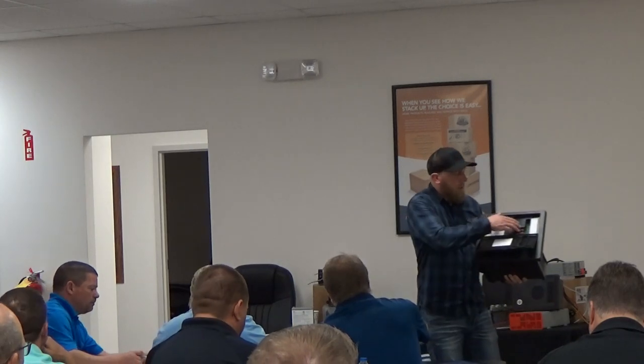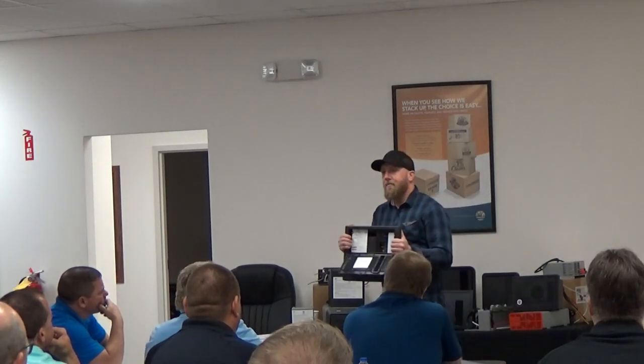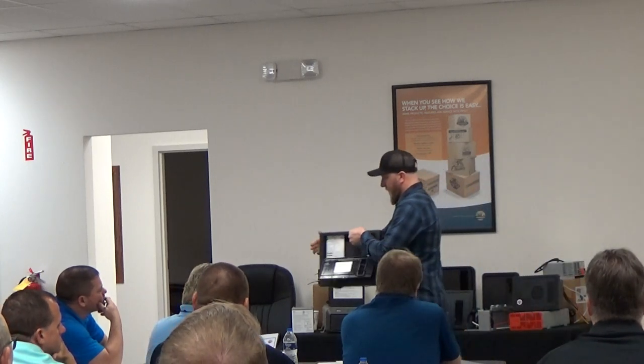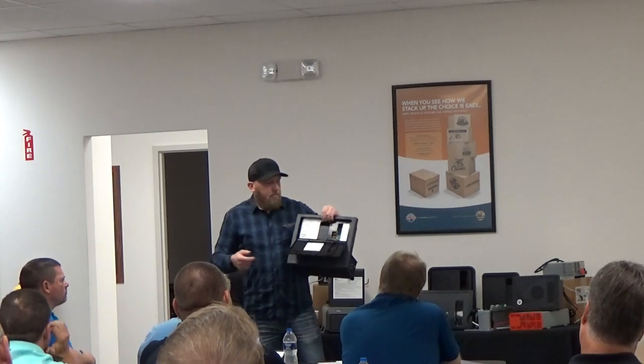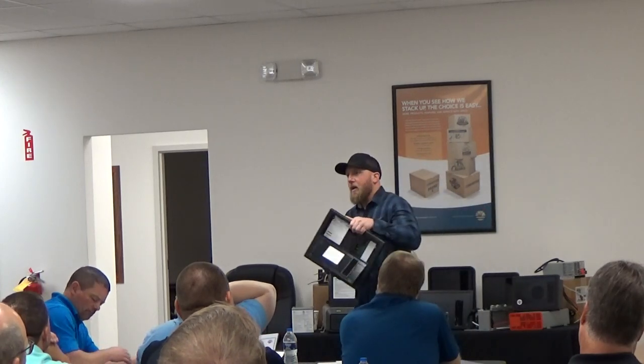Again, with this one, I should have brought a screw gun. This has screw terminals. It's not pre-wired like our 8700. You can see there's a screw terminal for each of the 11 DC circuits in there, so they actually have to manually wire it and then tighten it with the screw. So when you have a red LED on with these, it could be they didn't twist their fine threads together and put it in the screw itself, so it could be touching the screw above or below it. A lot of times we tell them to make sure it's twisted up really good, and that the wire's under the one screw, not touching something else in there. That would explain why a red LED could be on here and the fuse is actually good.